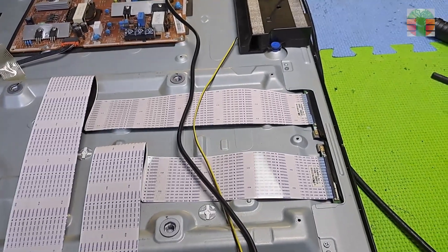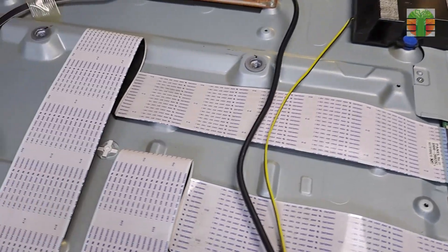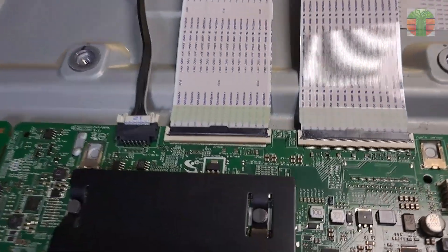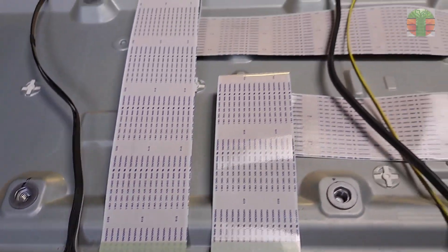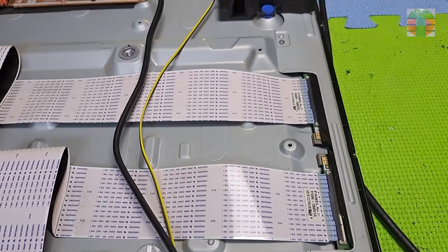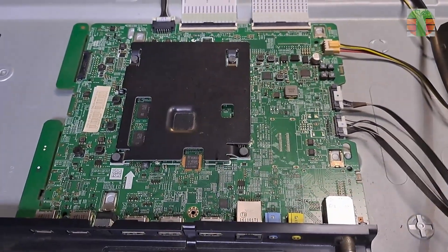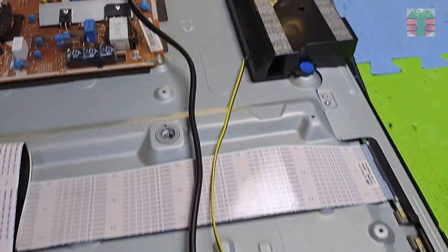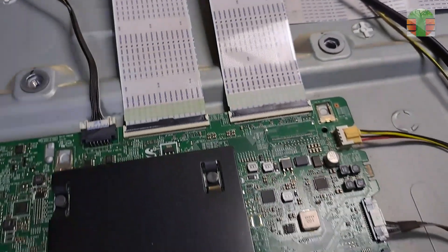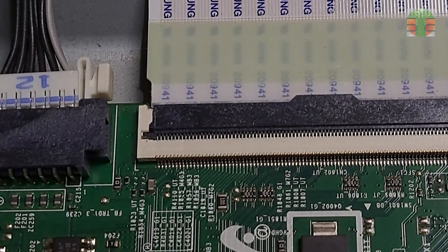The vertical and horizontal lines that appear on the screen are usually caused by a bad clock signal. That may include the clock signals CKV1, CKV2, CKV3, CKVB1, CKVB2, and CKVB3. The signal generator is not the problem, but the LCD panel gate clock inputs. The bad signal input may be on the right side or on the left side of the LCD panel. Disconnecting the bad CKV lines will solve the problem.